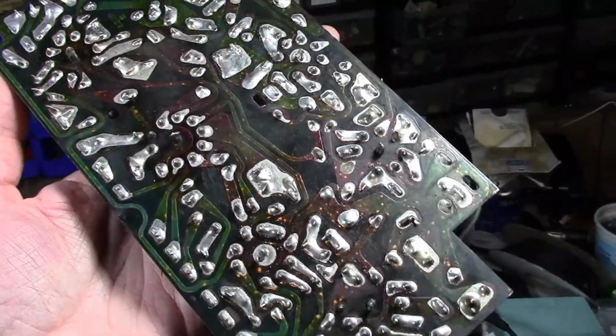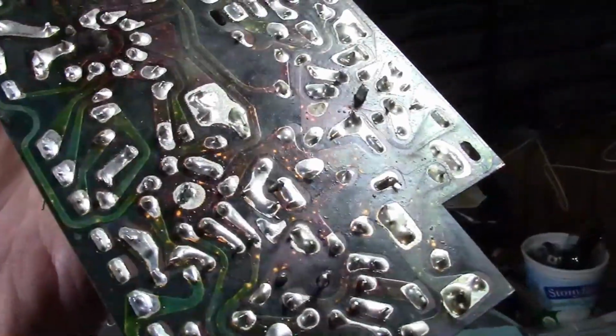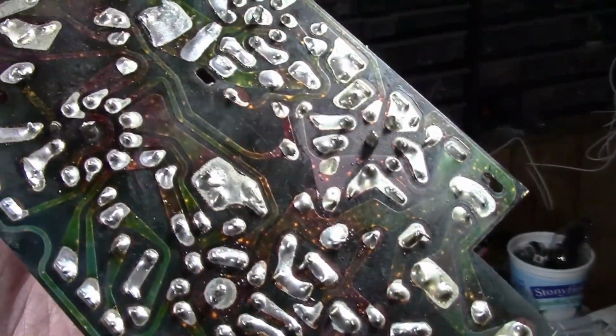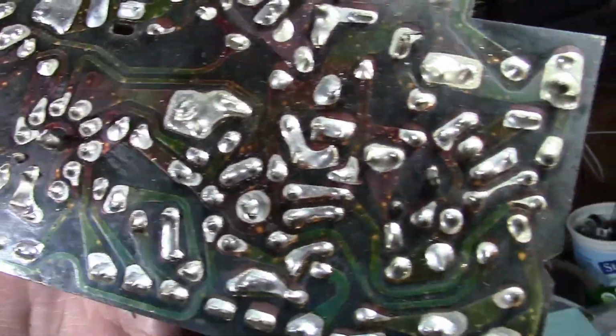And the circuit boards, they're phenolic boards, and yes, the copper foils can lift off them. Same with everybody else that was using circuit boards back then. Use a lower wattage soldering iron, keep the temperature down, and don't stress the leads. And as far as it being darkened around the tubes, tubes get hot, that's what happens. Not a big deal.